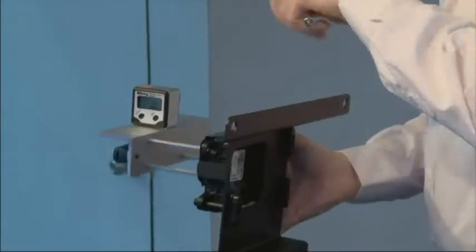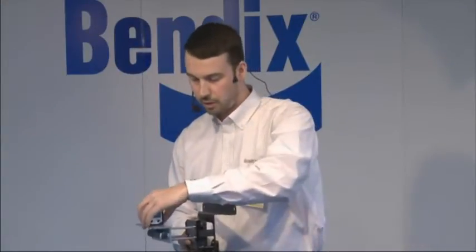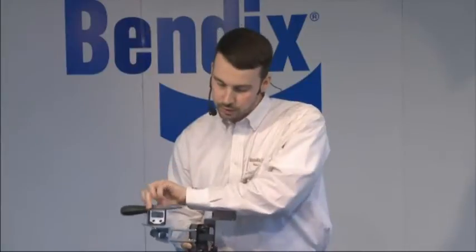You want to get as close to zero degrees as possible — plus or minus 1.5 degrees is allowable. If you're off by two degrees, take your Torx T20 driver and this time adjust the top corner screw, because that screw adjusts the pitch of the radar up and down. We're only working with two screws on this new version. Make small turns and watch the degree number on the inclinometer to see how much is changing, then get it zeroed out.